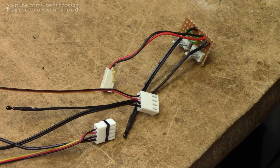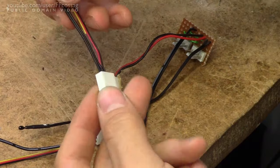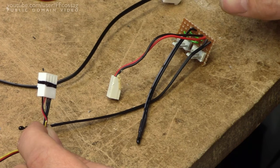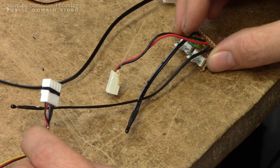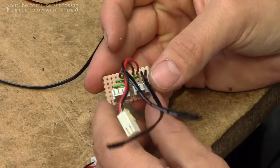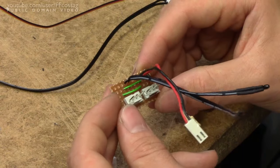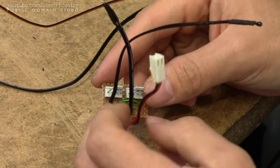There are the finished fan connectors and a little adapter plate to connect everything up. I've connected the thermal sensor lead to 2 pins, power to another couple of pins, and that's it — the same way on both fans. I've marked up one of them to match it with the original temperature sensor, because I don't know if they're calibrated for the particular NTC. The adapter board is very simple — just a couple of jumper links. I took 2 fan connectors, soldered the NTCs to 2 pins, and paralleled up the other couple of pins. That's going to run to the fan power output on the UPS main board — just power and signal, no smarts whatsoever.